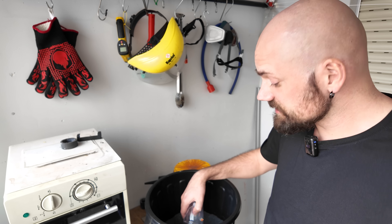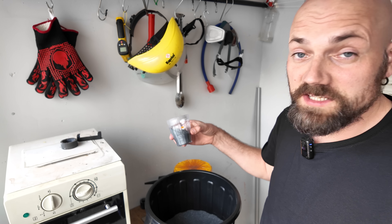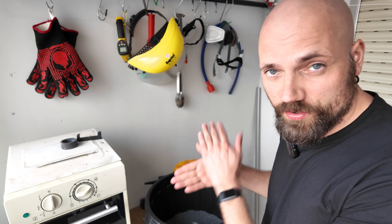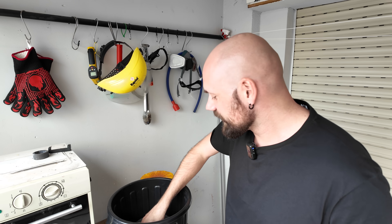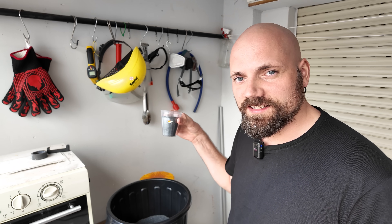Silicon carbide can seem expensive, but if you buy in bulk it works out to approximately €5.20 a kilo. In a previous video I made a grinding blade to grind silicon carbide — after using it for a while, it's not that great, similar to the original. The last batch I bought is FEPA 80 because they didn't have FEPA 220 in stock, and this coarser grit is not ideal for making molds. But I decided not to wait for the perfect grit and just make the mold with FEPA 80 silicon carbide.